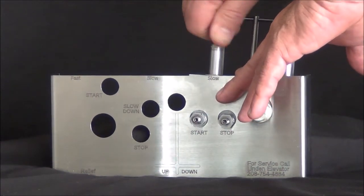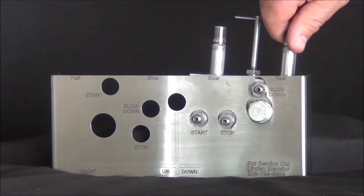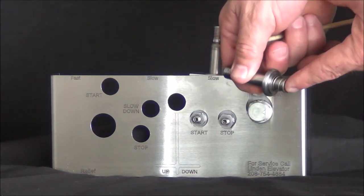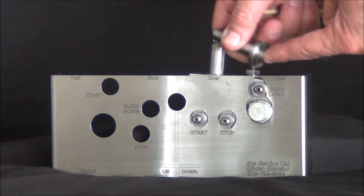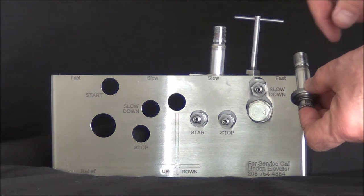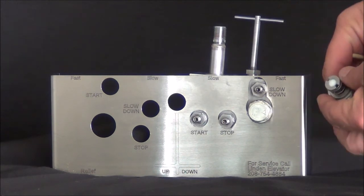For ease of working in this video, we have previously loosened one of the solenoid tubes and we're going to expose the internal working components of the solenoid. When you remove it, this shuttle should move quite smoothly — it's got a spring that will keep pushing it back out. If it's stuck in the up position, obviously this is a problem and it needs to be cleaned most likely, or it's possible you could have a dent or a bend inside the solenoid tube. This shuttle is a reasonably tight fit, so any little bit of debris will cause an issue.